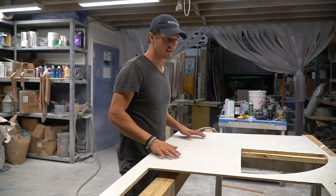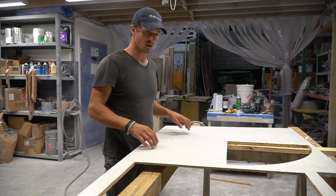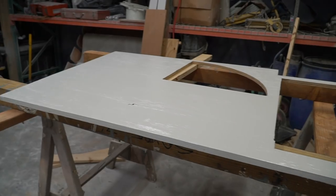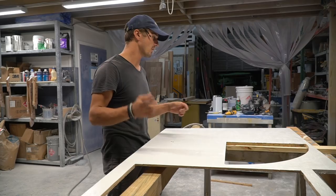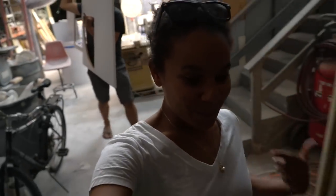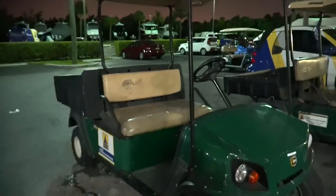We finished cutting the three-quarter inch wood that's going to act as a base for our countertop, and cut out all the spots for the sink and to access the lazy Susan over here. I primed the bottom — the underside — just to help seal it. Technically this is marine grade plywood, which means it has waterproof glue, but I'll coat it anyway so it lasts more than a couple of years. Now we just have to bring it back to the boat. We changed docks yesterday so we're a little further from the shop, but the office is letting us use one of the golf carts to carry our stuff back and forth — after hours golf cart ride.